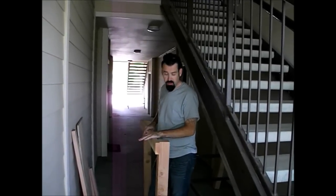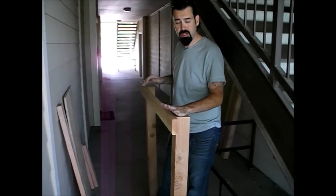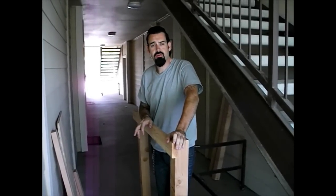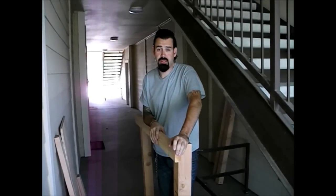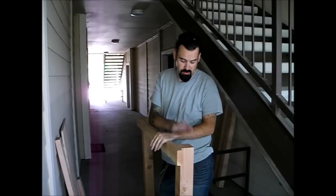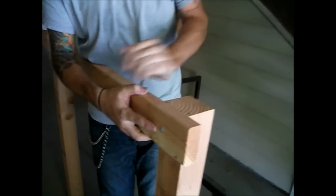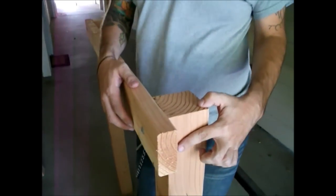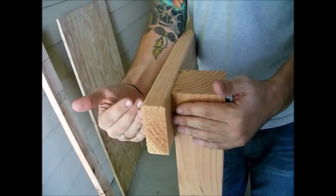I've started to assemble the skeleton. It's going to be about the right height for me — I've got a good place to do any type of reloading, whether it's handgun reloading that doesn't require a lot of torque, or rifle reloading that requires quite a bit. The first step is taking the 4-foot 2x4 and attaching it to the 4-foot 4x4s using carriage bolts — a quarter-inch carriage bolt on either end. I've pre-drilled holes through both the 2x4 and the 4x4, and offset it so the 21-inch 2x4 can sit in and be secured with decking screws.